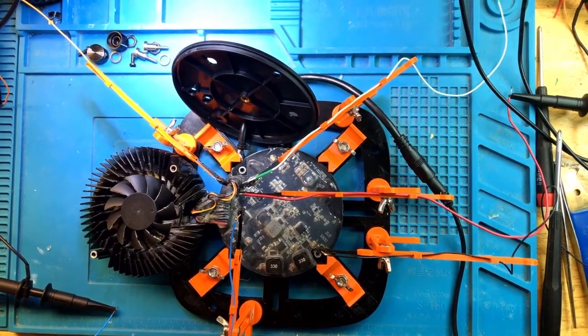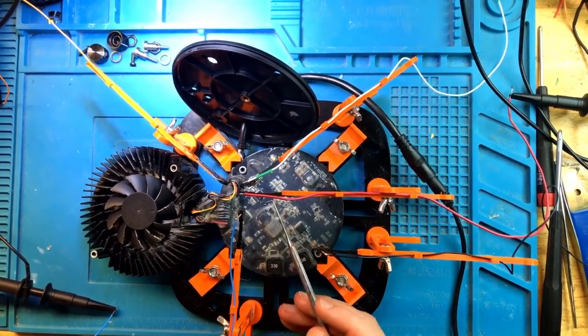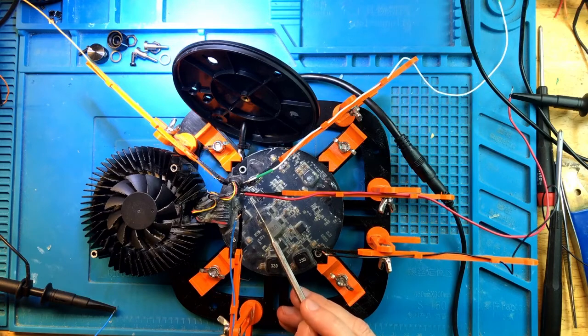All right, so we've learned quite a bit about the operation of this control circuit. And we know that there is somehow a problem that occurs that has nothing to do with current consumption. It has nothing to do with the control circuit shutting down the MOSFET because the timer times out. And the timer, remember, is the primary reason for most of the things shutting off, except for the immediate circuit breaker, I think. So this is the time when we theorize about what might be going on.